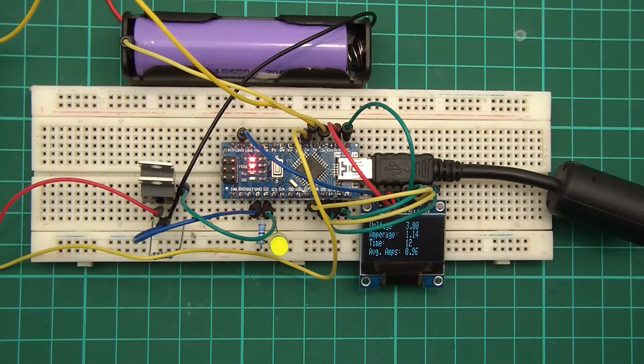We need a resistance within a range. Sometimes people say 10k or whatever, and usually they'd be right, but I like to try a range of different ones and choose my own. I'm guessing I can get away with a 5k resistor, so I've got some 5k resistors here and I'm going to give it a try.